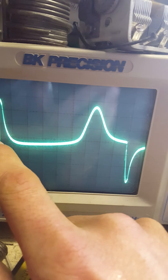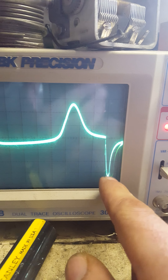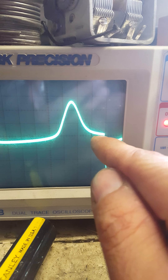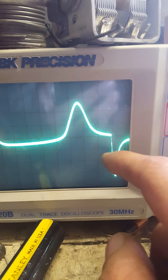There's an initial little bell ring here that ramps up before the AC wave — the DC pulse — before the AC wave starts. And then there's another one that happens as well before we actually have the drop. So it's almost like we get two pulses out of whatever's resonating here before the polarity flip-flops and drops down, because I'm only using one side — only 30 hertz coming in, only when this hot wire goes positive 30 times a second. So that's the only time we pull the electrons from ground and are able to pump this circuit.